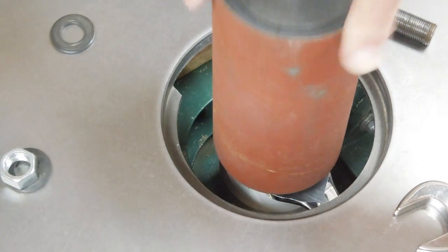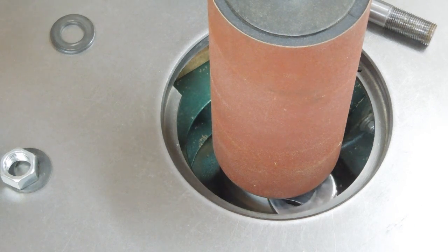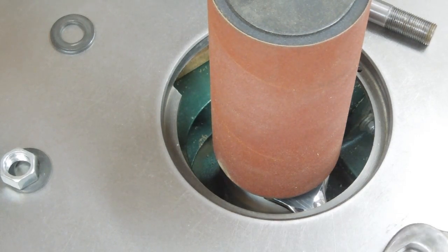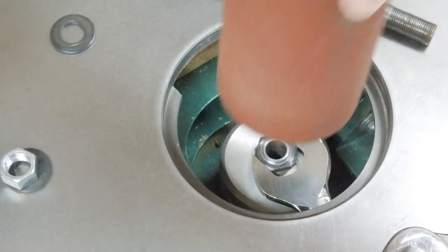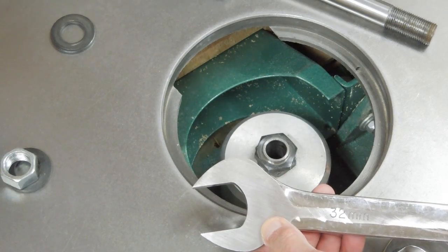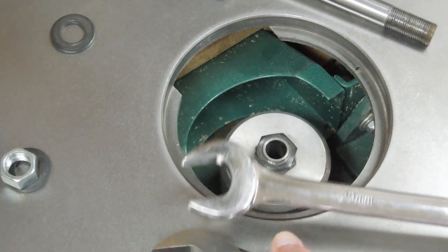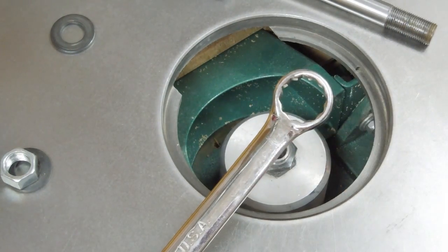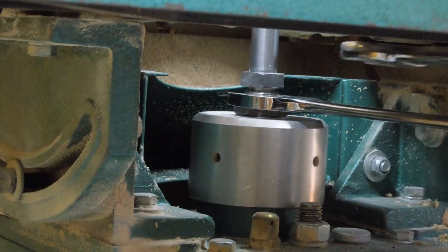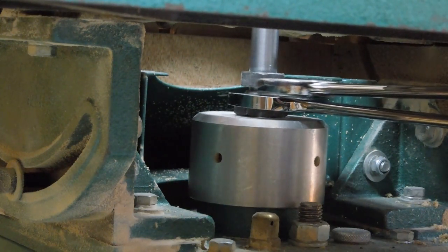If this big monster is in there tight and gets jammed, I can reach in here — I don't have to see what I'm doing, I can feel it — I just loosen it up and take it off. That's why I chose to grind on the 32mm wrench first, because I was hoping I didn't have to touch this one at all. What I will do is cut this box end off to get it out of my way. Slide that wrench on there, put my other wrench — the 29mm — on top of the 32mm, and just slide that right on there.